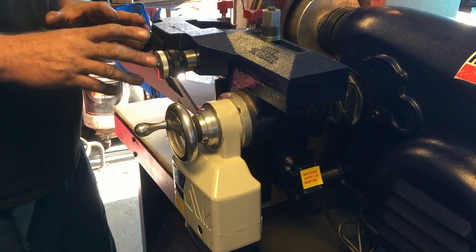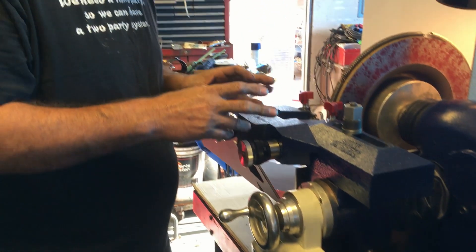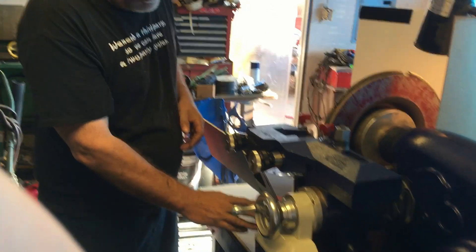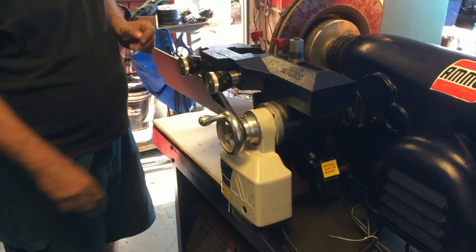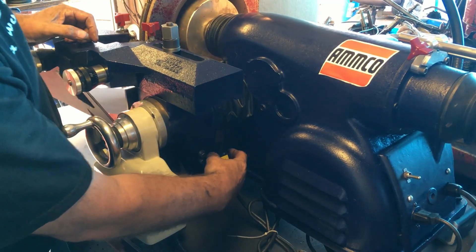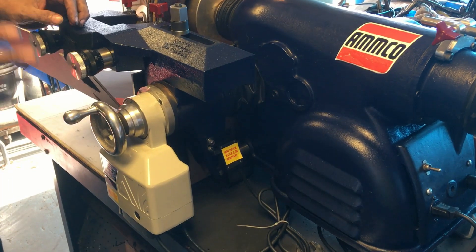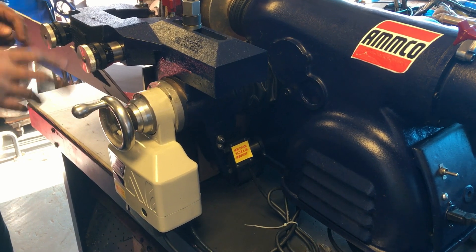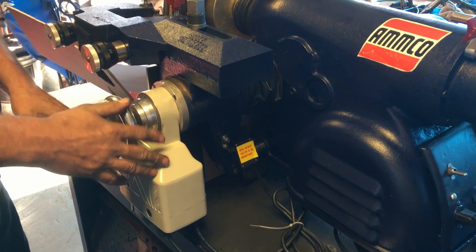It actually makes for a really fast machine. I can make the first cut as fast as anybody, and I can make a second cut a lot sooner because I have this button over here for a high-speed return — I can scoot right in. There's a limit switch mounted over here so if you run it in too far it won't hurt anything; it just stops. It's pretty hard to break and these are really reliable units.